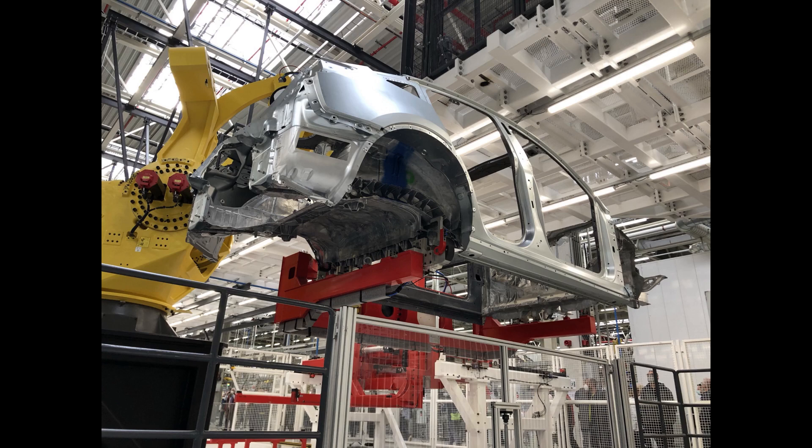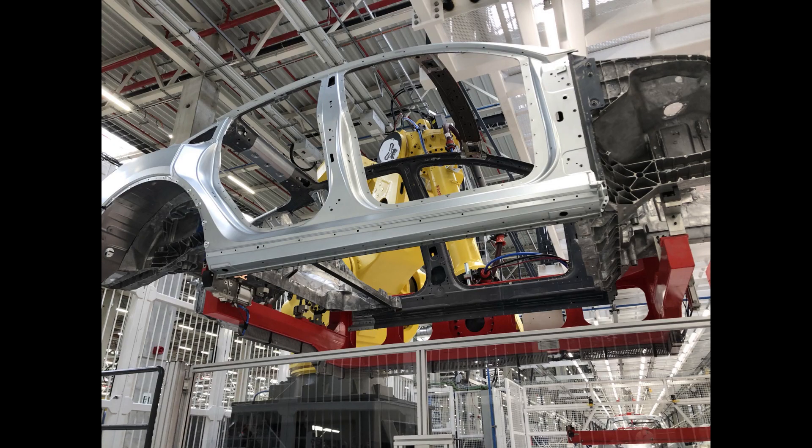The first signs of the structural battery pack in the Model Y were visible in the car body assembly line. Here in the picture you can see a large robot called King Kong, which lifts the car body from an upper conveyor belt level down to the factory shop floor level onto the car body assembly line. Clearly visible underneath the car body is a large open frame where normally the floor of the car would be. You can also see the front and the rear casting, which are the forward and rear ends of this frame.